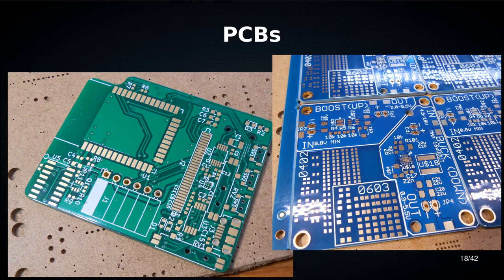Okay, so let's look at these elements on an actual PCB. We don't have any exposed fiberglass here. You can kind of see the fiberglass color in here between the actual boards. Here we have PCB with solder mask, no copper, and here we have copper on top of that, and you can see patterns in the copper. These are called traces, and here is a via. That's a hole that's connected to the copper. Here's some more of those. Here's a hole that's not connected to the copper.